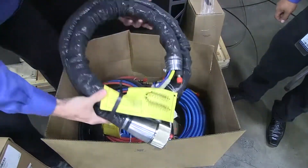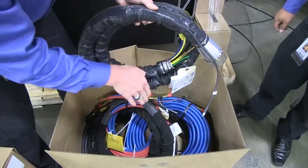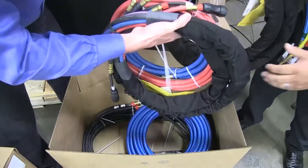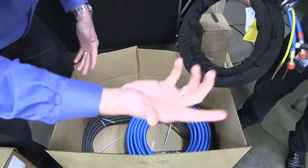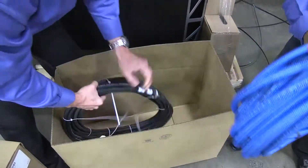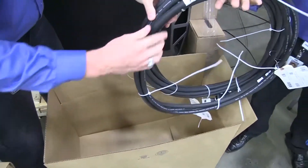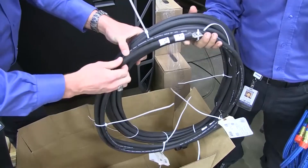Let's see what we've got in the box. First off, this is the torch lead — that's what connects up to where the torch actually connects to the table. It's got a sweet cover on it. There are all the other cables that connect between the various gas console and torch box. That is one of our gas lines. And then there's the grounding cable — obviously nice and big. When you're dealing with lots of high power, you've got to have big, heavy cable for grounding so you're not hampering the system's ability to push through that amperage.